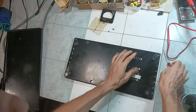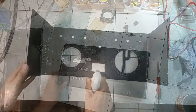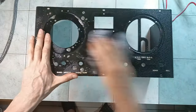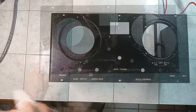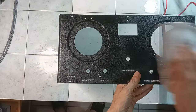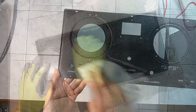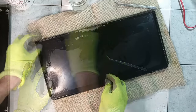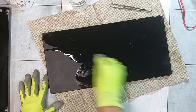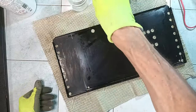Four feet on the bottom panel can also be removed. A more intense cleaning is attempted with the same oven degreaser tested before, but this time the writing seemed to suffer from it. It is then the turn of a product containing phosphoric acid for cleaning from the superficial rust. Where there is a little bit of corrosion, some fine sandpaper helps in removing the harder rust residues.